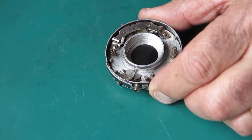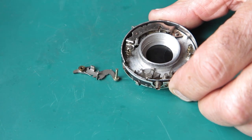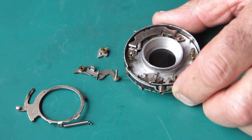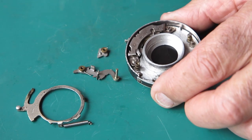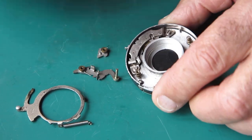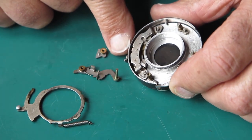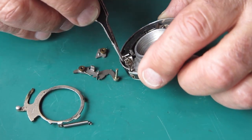There are some control levers to go on here for the shutter release - the little piece that blocks the action of the shutter release if the shutter hasn't been cocked, which saves you wasting a frame of film. We'll get these pieces cleaned and in place. There's a bit of staining on those shutter blades, but they are clean and there's nothing there to cause any worries.